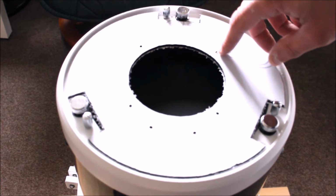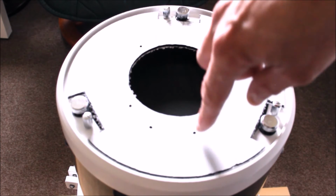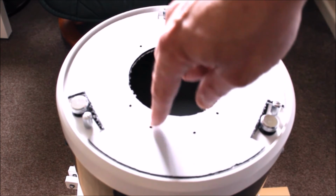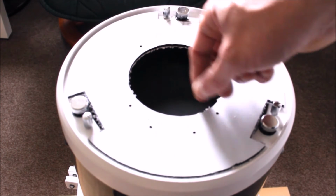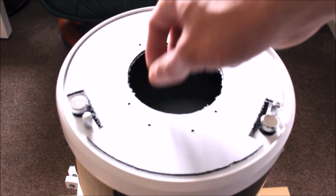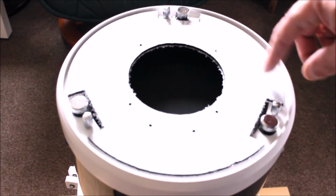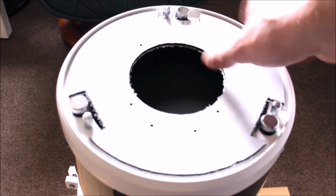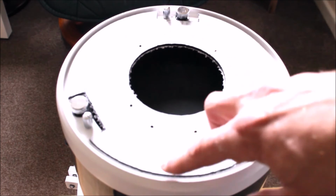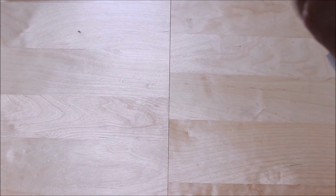Using a 2.5mm or 2mm drill bit, using the drill or Dremel, just mark down the holes, and the holes there for my little project box to put all my cable in. So that's what we have now. Looks impressive. We'll proceed to the next step. Bear in mind, with different modifications, you need to check the inside diameter. Okay, this is more than ample. We're basically going to peel off the plastic. Okay, peel it off. You don't want the outer coat of plastic.